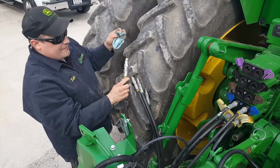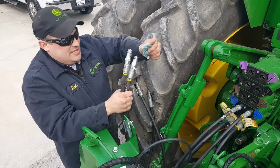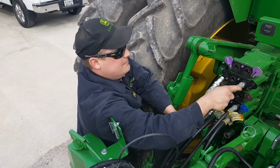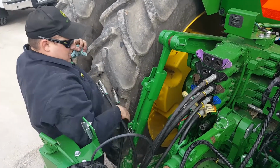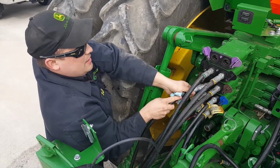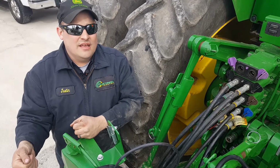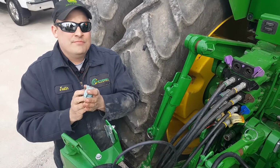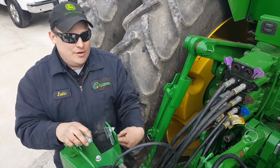Then you're going to come to your vac pressure and vac return. This is where a lot of guys make mistakes. Your vac pressures you want to put on the right hand side, and your vac returns you want to put on the left hand side. So what happens is when guys push forward with the vac, they could go all the way into float and bring the motors to a slowdown. This doesn't bring the motor to an abrupt stop and ruin the seal on the vacuum motor.